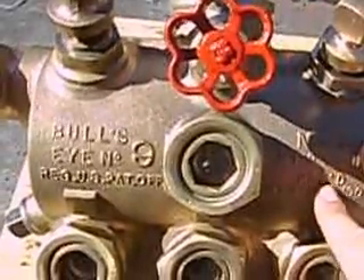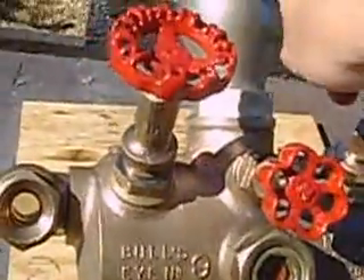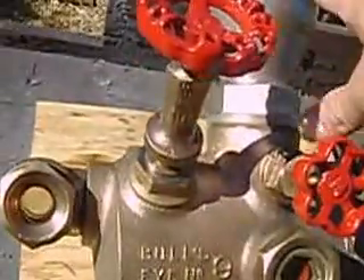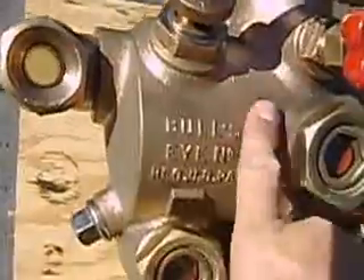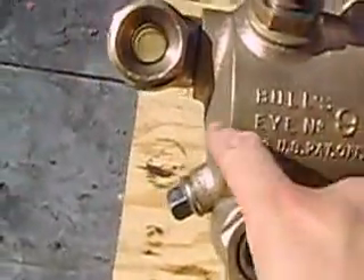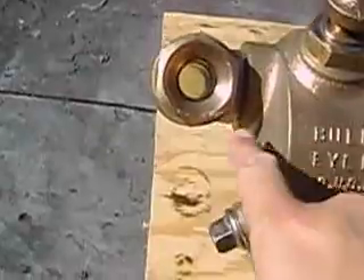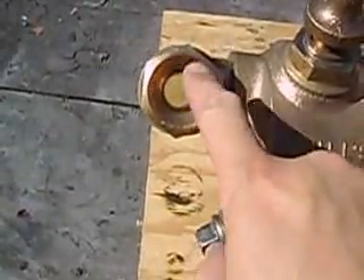The reservoir was filled with valve oil for the steam locomotive. Steam would come in here, and by then it was mostly high-pressure, hot water. The water would settle to the bottom and float the oil up on top — that's what this glass is for. It's at the very top so you can see where the oil level was in the reservoir.